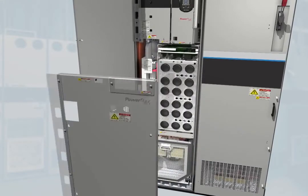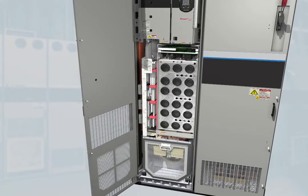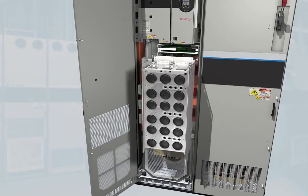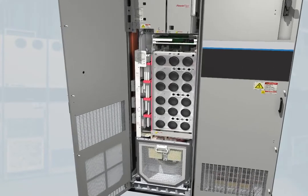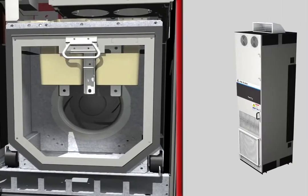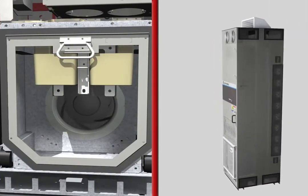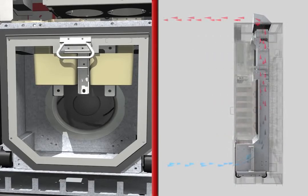It's easy to access the circuit boards mounted in the front. In addition, the entire capacitor bank can be removed, allowing access to the IGBT assembly without rolling the inverter out. The drive features a high-volume fan that is also easily replaceable. This fan pulls air into an isolated air duct to cool the drive's heat sinks, preventing excess dust and dirt from being pulled into the cabinet and minimizing the amount of cooling necessary.